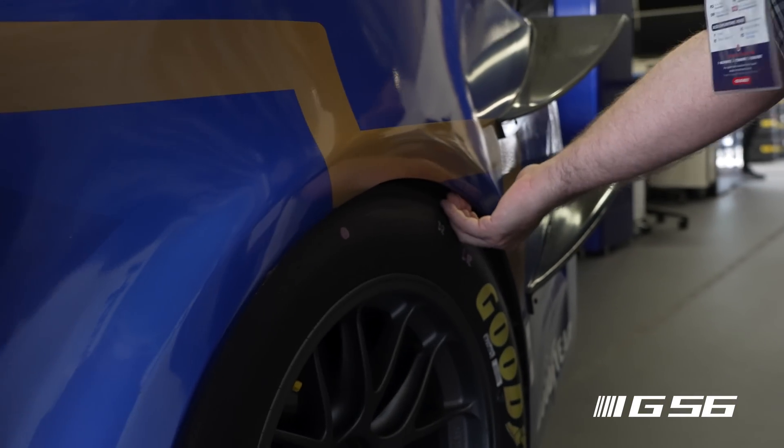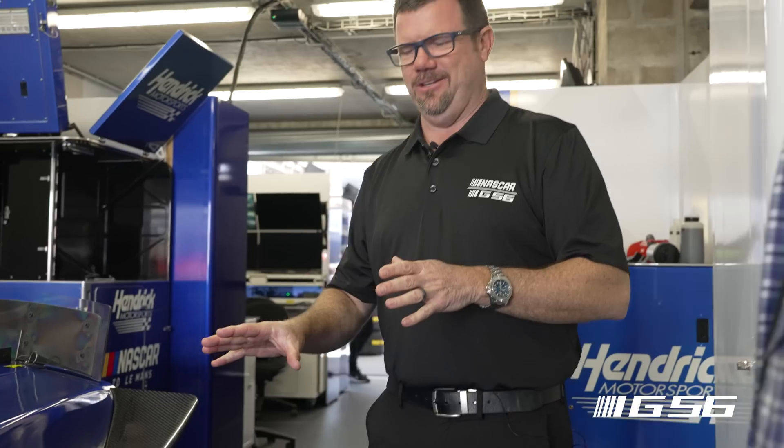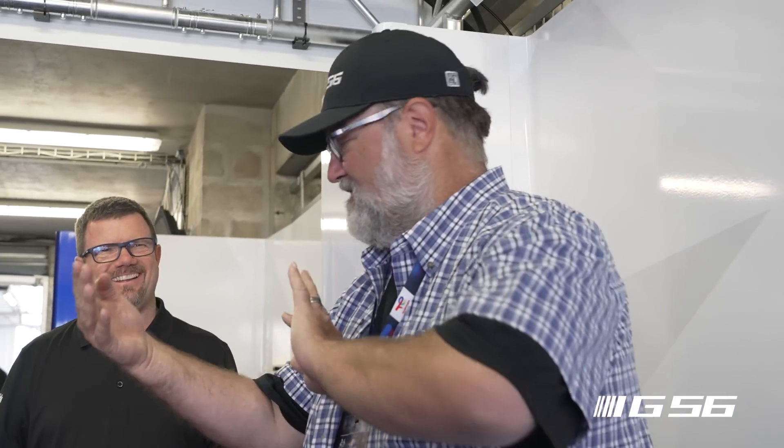If you're just looking at the width here, there is not a lot of space — you have maximized it. It's pretty sexy. In road course trim you're going to run negative camber on both sides. With the oval car with positive camber on the left rear, we could never run this width — that's why we're locked in at 12 on the cup car. Brandon's nickname is 'Stance,' by the way. He's all about getting the wheels and all the fender fit right.